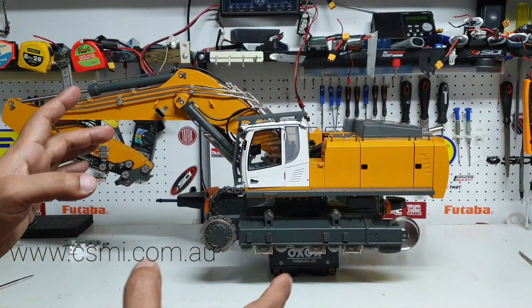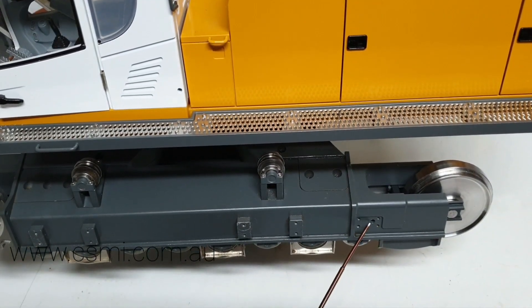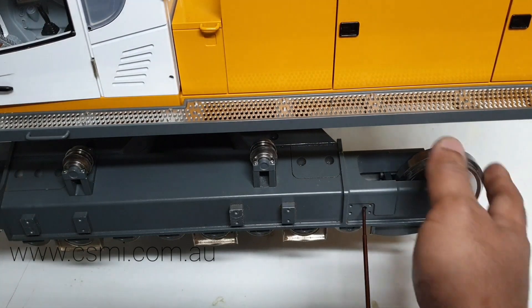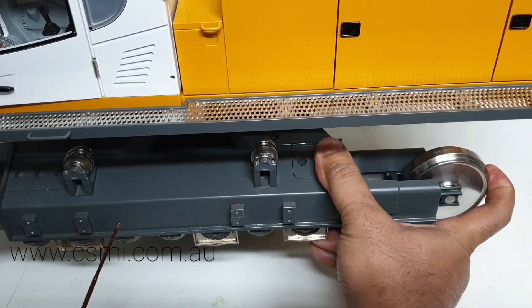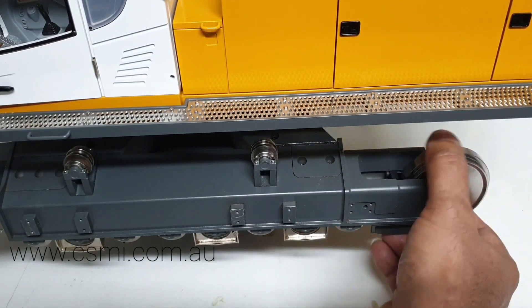So how did I get the tracks off? Quite simple. Up here you can see there's a plate, and I've taken it off now. There are four bolts on this plate. Once you take it out, you can see there's a hole up here, and what you do is compress it using an F-clamp - I'll show you on the other side as a demo. Once you compress it, you put a pin in there and lock it in. This idler wheel is on a spring, so you can see it travels. It's pretty hard to compress with just a finger, hence we use an F-clamp.